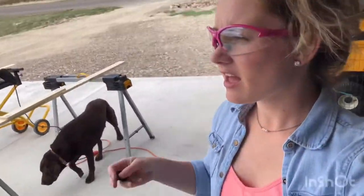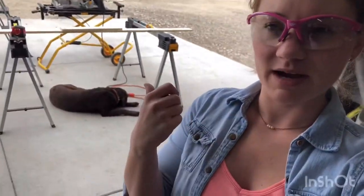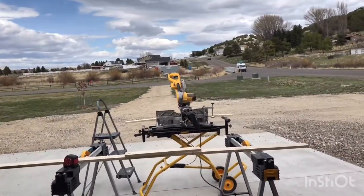I'm going to talk in here because outside is kind of windy, but you can see behind me I've got everything set up. Normally I like to sand first with the belt sander, but I can't find it — I'm under the assumption my husband probably loaned it out to somebody without telling me. I've got a regular palm sander; it's just going to take a lot longer. So I'm going to go ahead and cut all of my pieces to size, give it a light sanding, put it together, and then sand again. That bowed piece on the saw right now — I'll cut it and see how it looks after it's a little shorter, but it's not looking good. I do have more lumber planned for another project — I'll make it work.